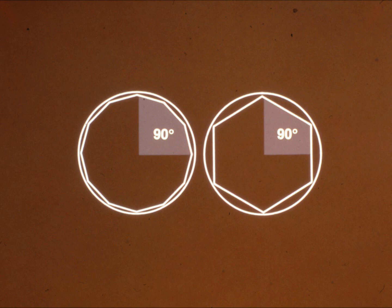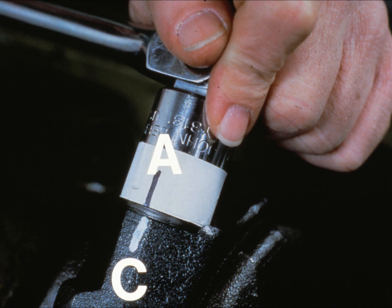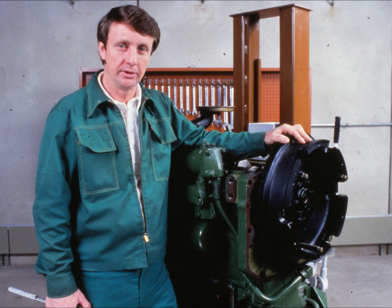On a 6-point socket, it's the angle from one corner to halfway on the next side. Put your socket over the cap screw and put a mark on the part next to mark B on the socket — call this mark on the part C. Then turn the socket until mark A is next to mark C on the part, and that's all there is to it. If the technical manual calls for it, you can also use the torque turn method with other than 90-degree turns. Just mark the appropriate angle on your socket and perform the method as you've just seen it. The torque turn method is the most accurate method you have for tightening fasteners in critical applications. Your technical manual tells you when to do it and how to use the method. But now you also know why it's important to use it.